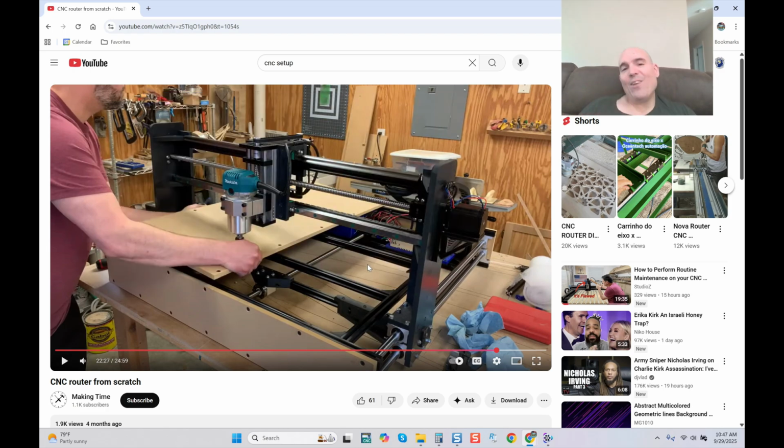What do you think is going to happen when you introduce a wood router from, again, a general hardware store or Lowe's, Home Depot, box store? These routers are simply not designed for these applications. And the issue is you have to use the proper double shielded cable to mitigate EMI, or you are essentially stacking issues. And let me be very concise with that.